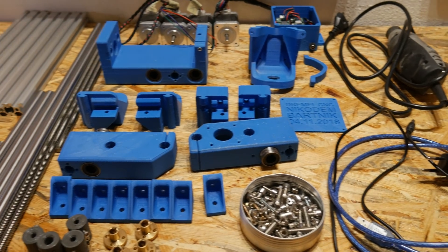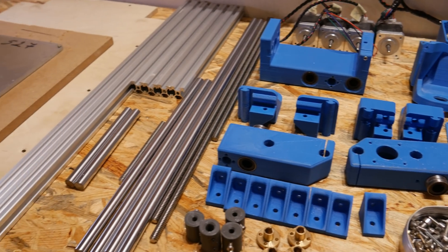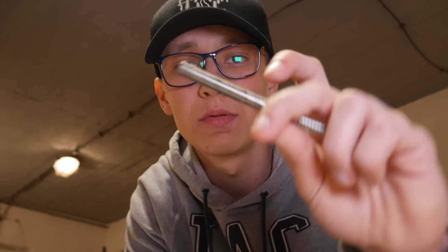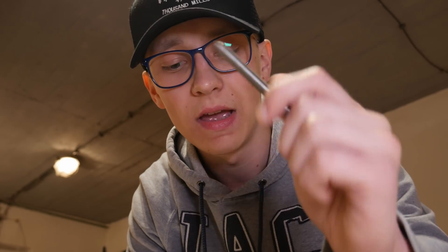Which wasn't a big surprise for me because a few days before I had disassembled the CNC completely. I have quite a lot of reasons for that. The first one: while milling aluminum, aluminum chips got stuck in the lead screw, and because of that the stepper motors missed a few steps and I broke the milling bit, so I had to clean the lead screws — I already did that.